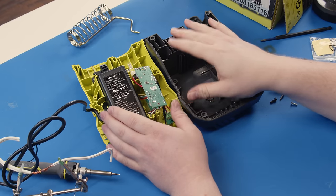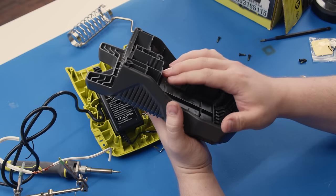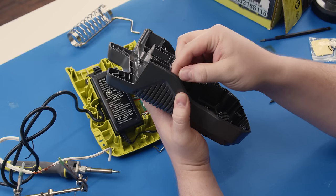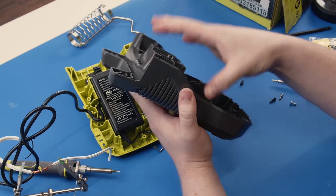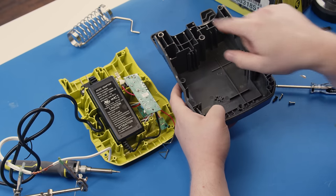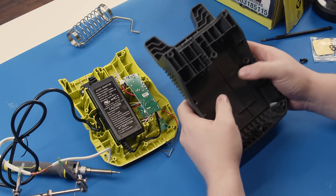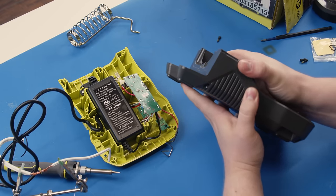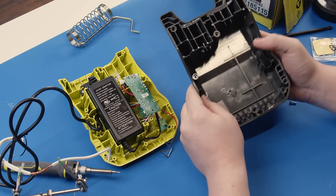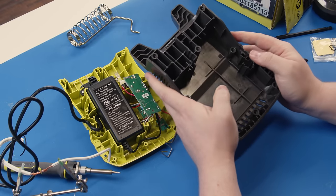And in fact, after I marveled at the density for long enough, it got me thinking about the heat situation. I don't work in industry or anything, but I've seen a lot of plastic in my time, and this is a really nice casting. It's got a lot of fine details, including this lip along here that interfaces with the one up here. It fits together so well that you think at first that there might be an O-ring in there. And even without that O-ring, I'm thinking to myself that you can't get much heat out of this thing. This plastic is so heavy and the gaps are so small that any heat generated in here is just going to get cooped up in there for quite some time. It's going to take a long time for it to diffuse through these thick plastic panels, and there are no gaps for it to escape from.